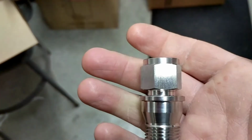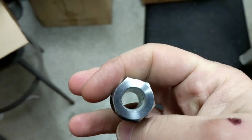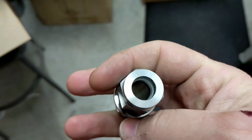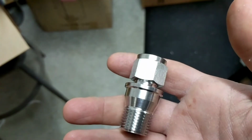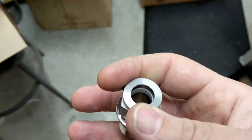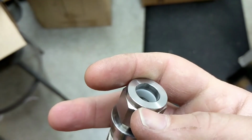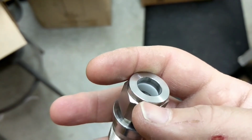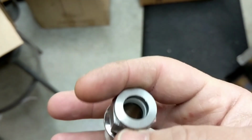So yeah, that's the pull through bulkhead that I was talking about. So that's 5/8. That's 1/2 inch OD. I need 5/8 OD. So anyway, I did go with a nylon ferrule. They're heat tolerant. I'll plan on breaking that connection to take my dip tube in and out once I clean everything. So that's why I chose nylon.